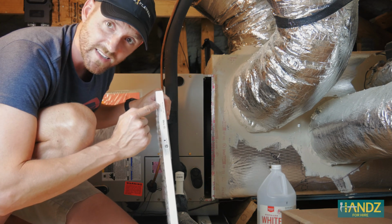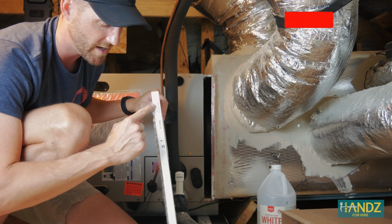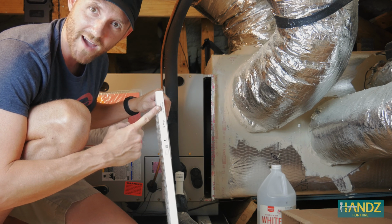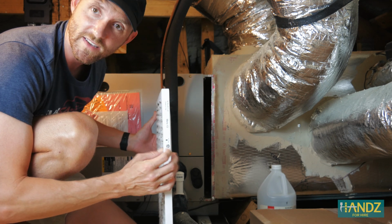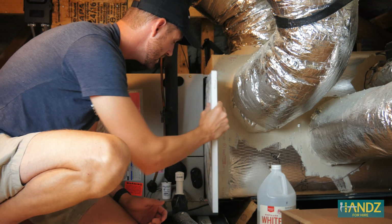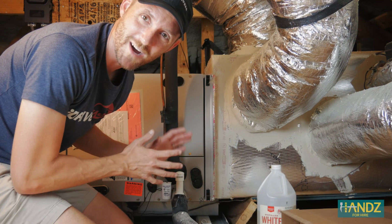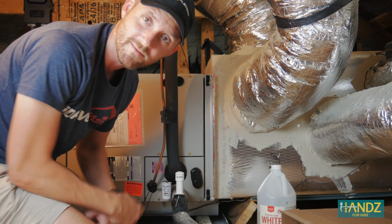You can see the dimensions on the side. Some of these HVAC systems have really unique filter sizes. This one in particular is 19 7/8 by 21.5 by 1. Not everybody's gonna have that. Make sure that you check to see which one you have and that you have some backups for future switch outs. You wanna make sure that the airflow is pointed the correct way so that this filter captures all the particulates in your line in the proper manner. Of course, the air conditioner had to come on right as I was changing it out, but make sure you get it in there, orient it the right way, close it up, and that's it. It's a really simple change.